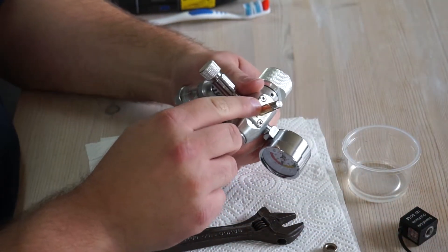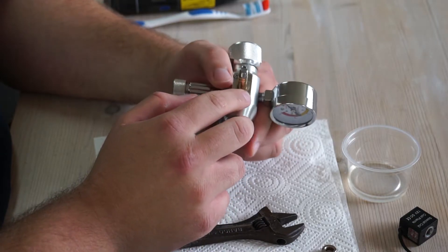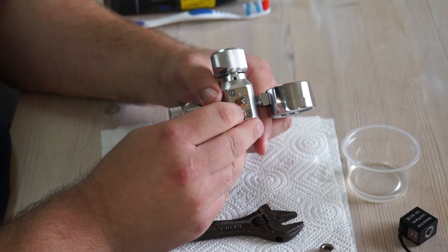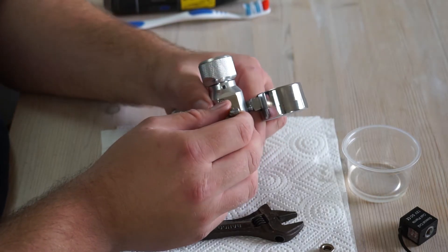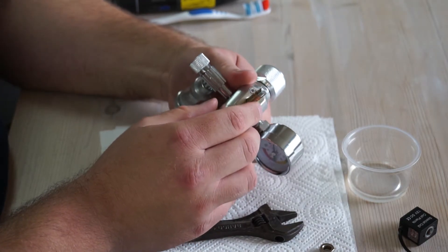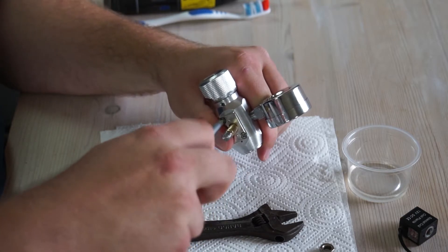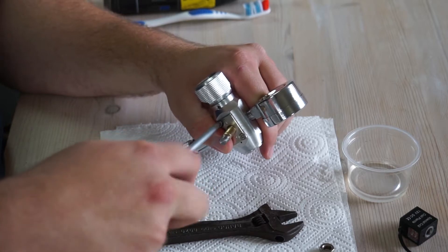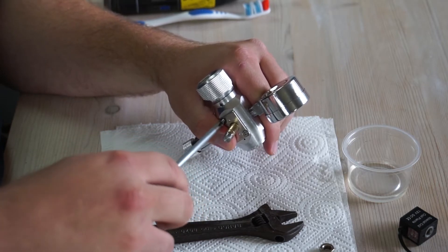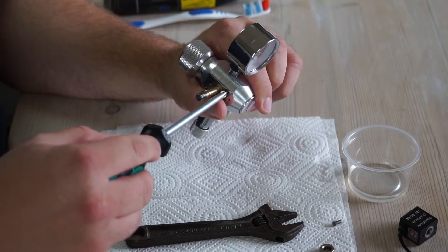But inside we have a brass tube, and I expect what happened was a lot of oxidation inside these parts — maybe galvanic corrosion from using different metals, or maybe some moisture got in. We need to disassemble it a little further. These are really fine threaded so be careful when screwing back on. Take note of all parts — you don't want to lose anything.